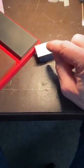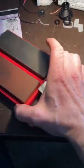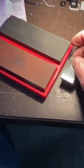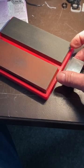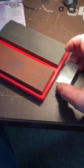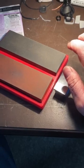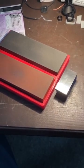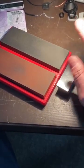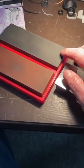So I believe, and you could forgive me if I'm wrong, I worked with a guy who worked on gliders. I used to fly gliders, and he did work on fiberglass work and other types of work. But really, that was his strength, was fiberglass work. And he would put body filler on a surface, and then he would sand, and then he would put body filler on the surface in a different color, and then he would sand, and he could start to see what's going on because of the change of color. And I think that's what you're talking about.